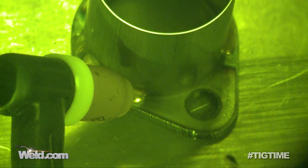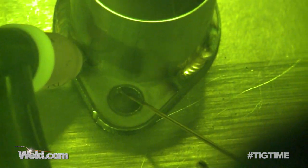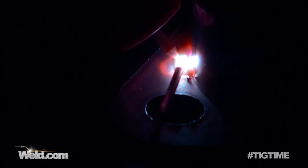Okay, I'm just dabbing just like you do TIG welding. I'm only doing about half an inch, three quarters of an inch, and then I get out of position. I taper off, use the post flow argon, turn the part, and start all over again. The filler melts first, then it attaches itself to the steel and stainless steel.